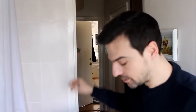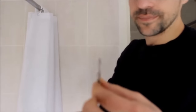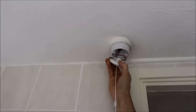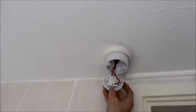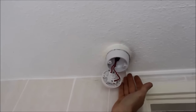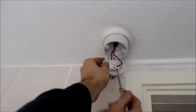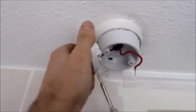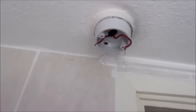Step two, we just line up and remove it. There are only two screws in it. You just use a flat screwdriver. As you can see, you now have two cables. There is no electricity, so we are safe to work on it. Just disconnect the cables — one cable out, take the other cable, and two cables out. So we got the switch out.